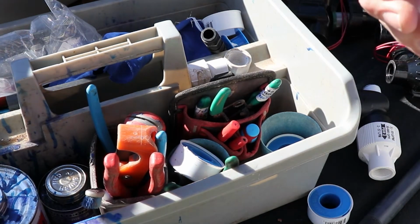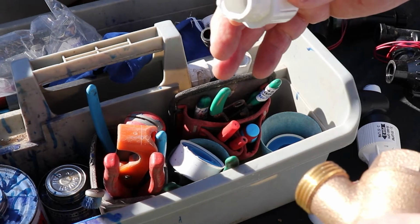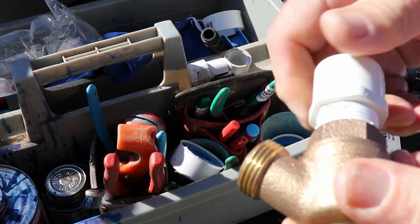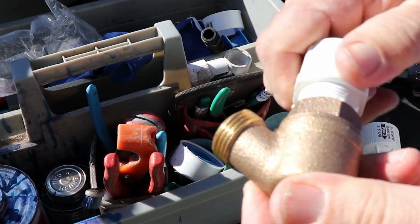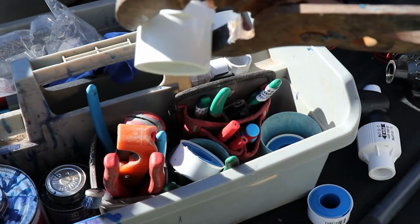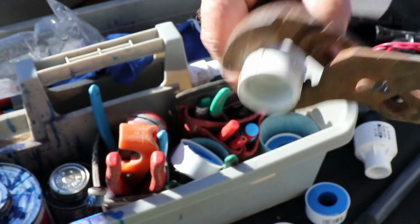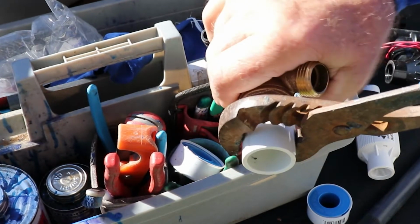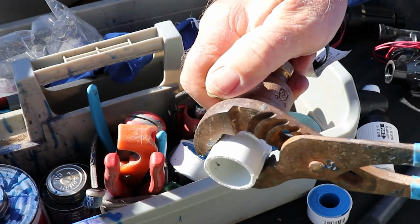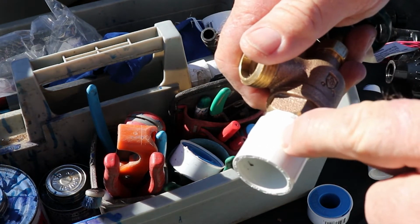I don't carry the Teflon paste in my tote all the time. That's why it wasn't in my other video. Then I just put that on. Then I use my channel locks to get it snug. And that's it. Any tighter than that, and you're taking a chance on this thing splitting over time.